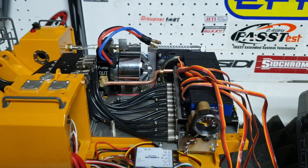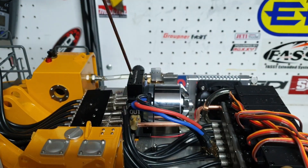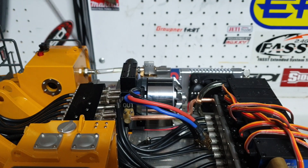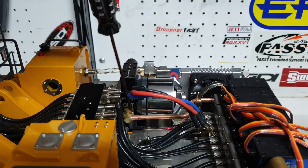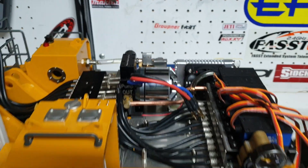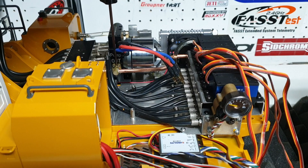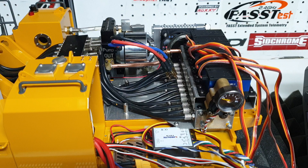Going back to the pump over here. You have a manifold in the pump up here. This particular manifold has a pressure regulating valve on this side — it sucks the oil and you can regulate the pressure. Then you have a solid copper line up here with a four-way bolting system or a flange, which then goes with an M5 fitting into the valve block. The good thing is, if you buy this valve block, you don't need to stick with their conventional four bolts and a flange because you've got an M5 fitting up here, so this can be used on all your standard machines for the M5.